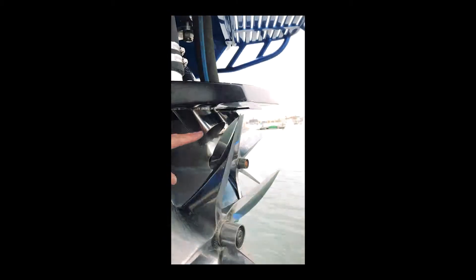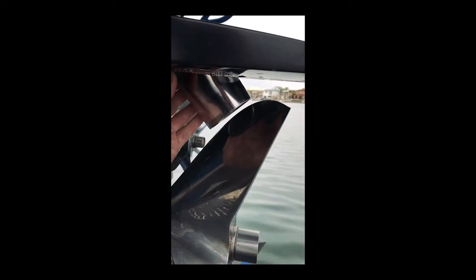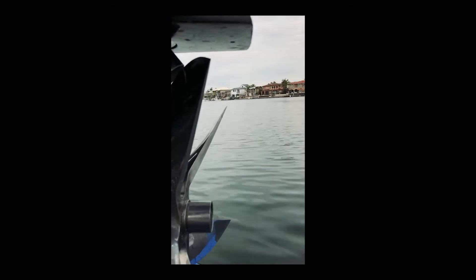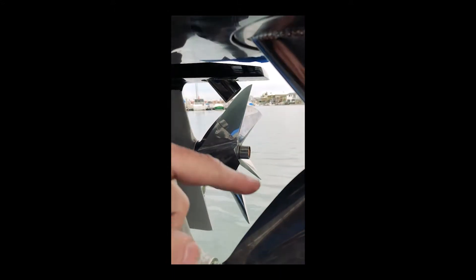Thank you for watching. I wanted to make this video because I couldn't find another video installing these aerators. One of the key things was finding the right angle. The way we did that: slide the prop out to the end of the threads, mock up a piece of tape at the right angle, tighten the lower vent tube, move the prop out so you can spin it without hitting, then tape it. Tape has a straight edge, so we taped up a mock piece to simulate the edge of the tube at the perfect angle, with the blade passing right by it, then measured back to find the right cut.